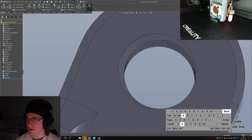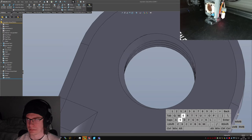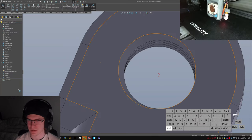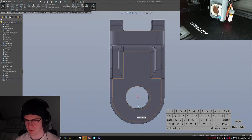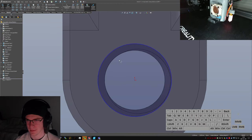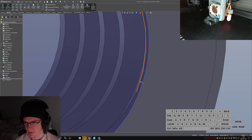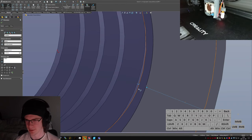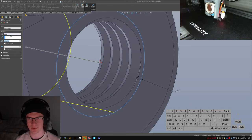Okay. That means that I have to do an extruded cut on this plane. Oops. From the bottom, please. Thank you, from the bottom. Favorite trick for making these threads look right: go to the outer surface, pick it to be just 0.4, however much chamfer you want, and then you can extrude a cone inward that cuts out just exactly as much as you want.